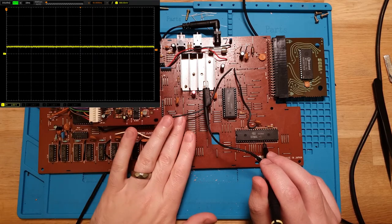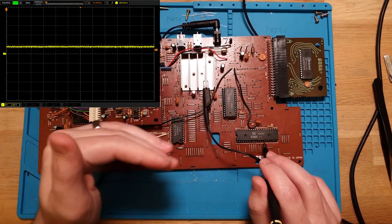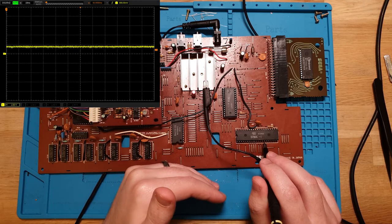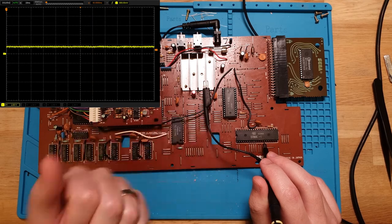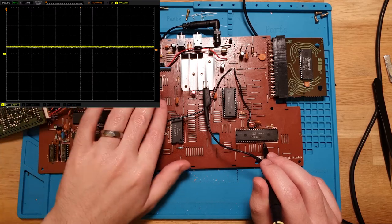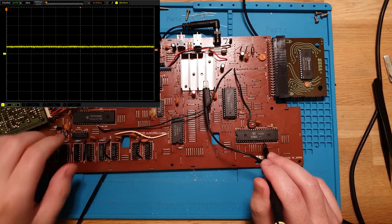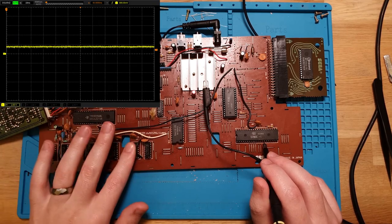Possibly one of the RAM or the other ICs turn on. At that point, everything gets pulled down. But why? I don't know. I don't understand why it would be pulled down to 1 point something volts, especially because none of these chips are getting particularly hot.